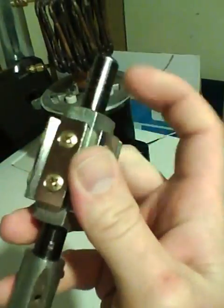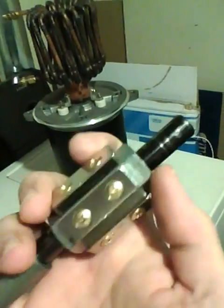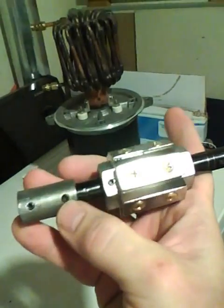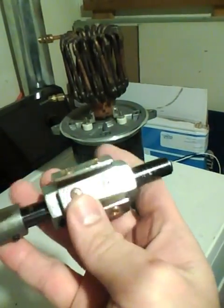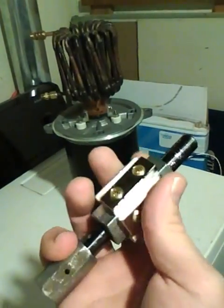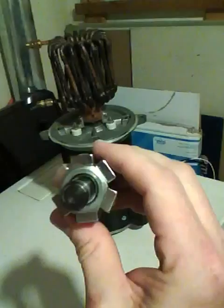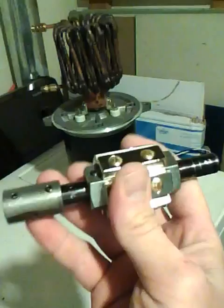The spindle is just on a nut I purchased at Home Depot — it's a 5/8 nut coupler. I used a half-inch extension motor shaft with a coupler that joins the shafts together, then pre-drilled and threaded some holes into the nut to hold the magnets so it can spin at 3,000 to 3,500 RPMs, vibration-free. It flows very smoothly — this is the cheapest way to place magnets on a spinning spindle.